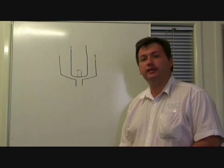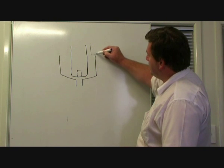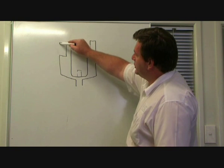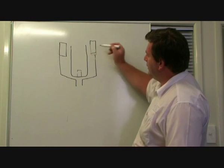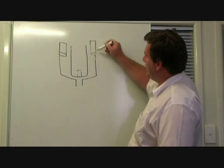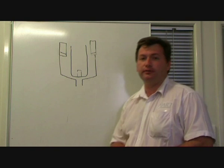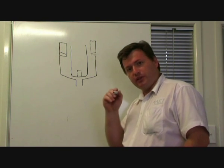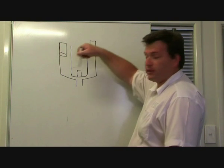Above the nozzle is a piece of ceramic called a swirl ring. Now this is a thicker piece of material, and it's usually a reddish colour. And this actually has very tiny holes in the swirl ring. And these go from outside of the nozzle into the cavities surrounding the electrode. These small holes are actually drilled in a spiral form, so that when the gas is injected, it forms a vortex.